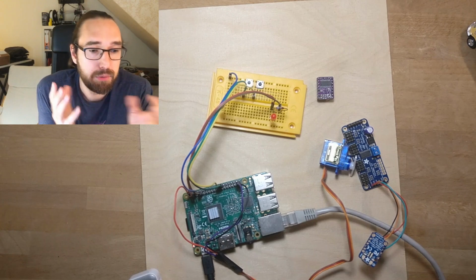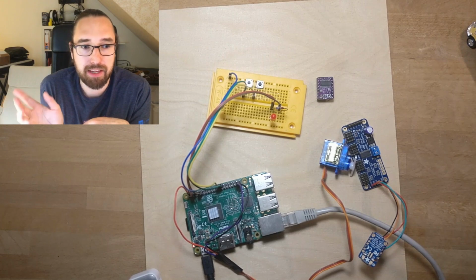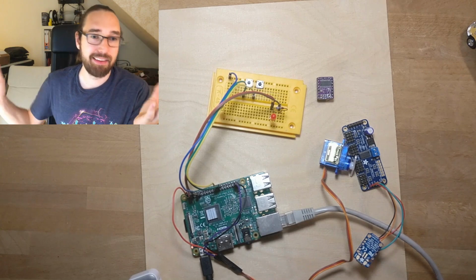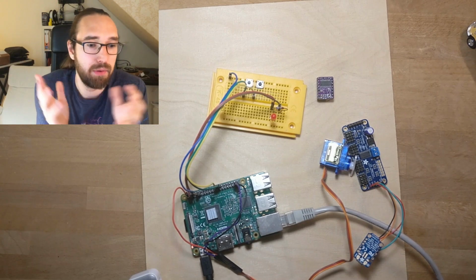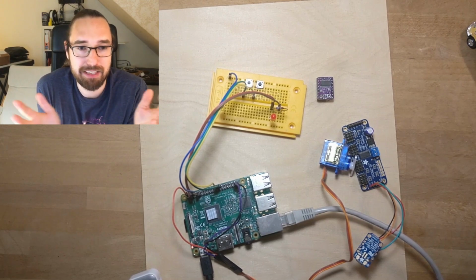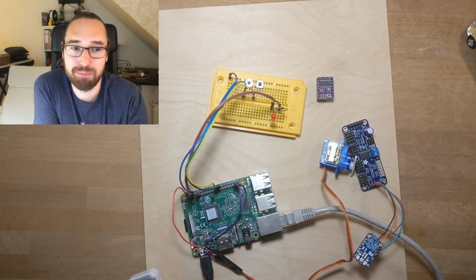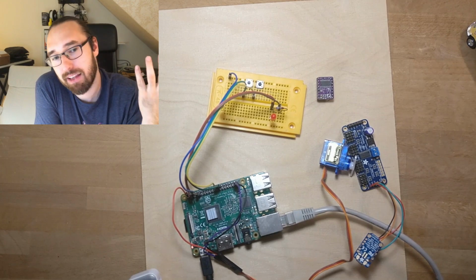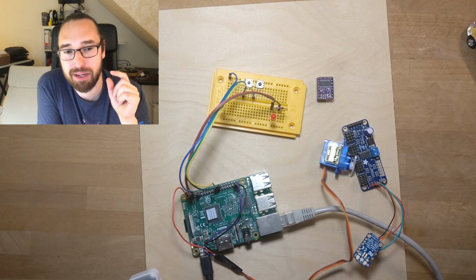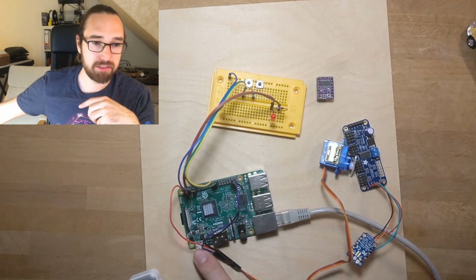If you want analog inputs, that's not available on the Raspberry Pi, but again there are I2C or SPI chips which can be interfaced with the Raspberry Pi, and then you can have analog inputs as well. That's the cool thing about this. It has so many interfaces, and you can interface anything with the Raspberry Pi. That's why I like the board, and it's cheap, especially if you think about a $5 Raspberry Pi Zero, which you can then interface via serial.